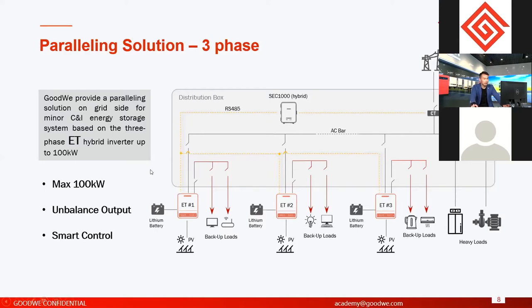And another thing is, you should be careful about the paralleling. The first is that it can parallel up to 100 kilowatts. It means, because for the ET the max is 10 kilowatts, all right? So in the parallel system, you can connect a maximum of 10 ET inverters in parallel,